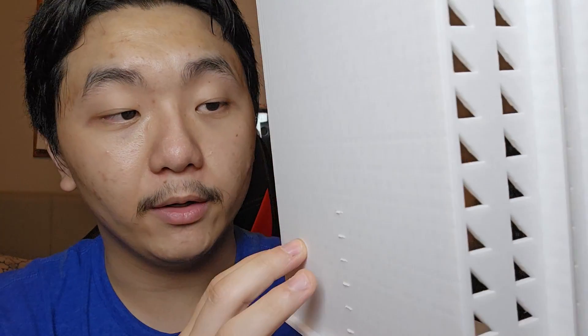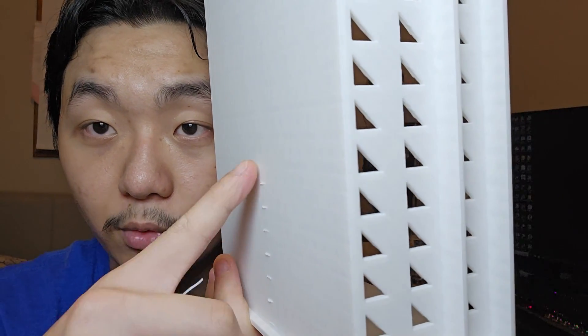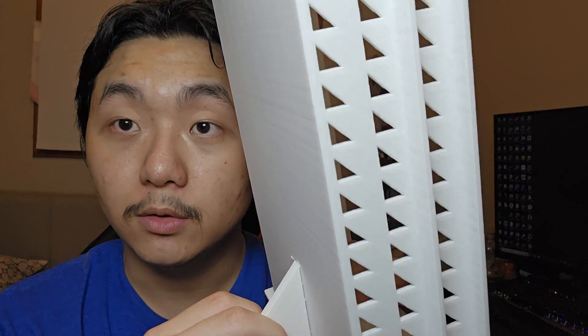It's a lot better and more sturdy than having this whole thing supported with lines sagging down. Of course, we've got to get rid of the brim — and it was that easy. When I generated supports the old way, it cost me almost 350 grams of filament. But with this teeny tiny custom support, it only took 250 grams of filament — it saved over 100 grams of filament.